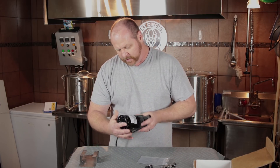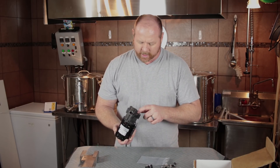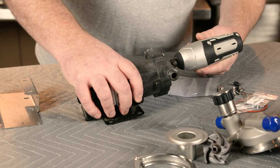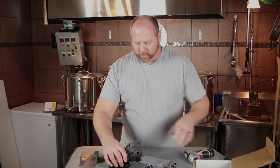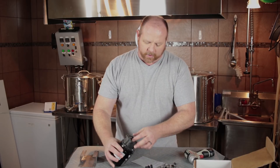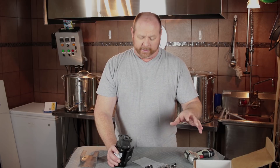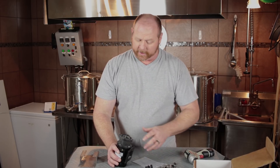This pump is the March 809PLHS, which has the polysulfone housing on it, and this kit is supposed to replace that. I'll be very curious to see how this pump performs once we put the Riptide head on it. In a previous side-by-side comparison video — I'll put a card up here — we noticed that the March 809 was probably the least performing out of the Riptide, the Chugger, and the March pump. So I'll be interested to see if replacing the head does in fact increase the performance, which would be pretty nice because it was somewhat anemic compared to the other two pumps.